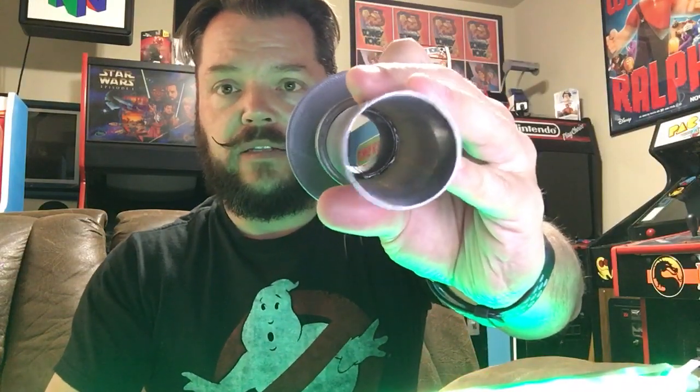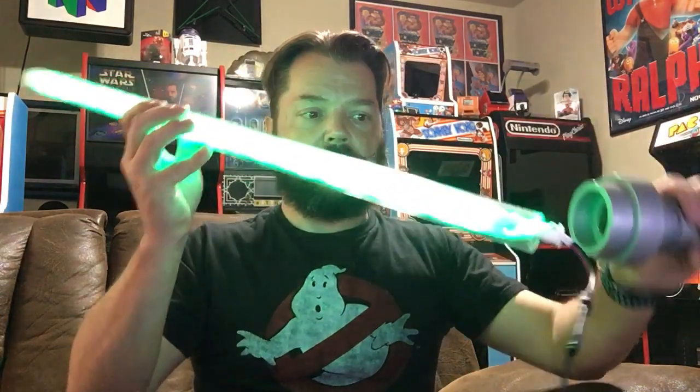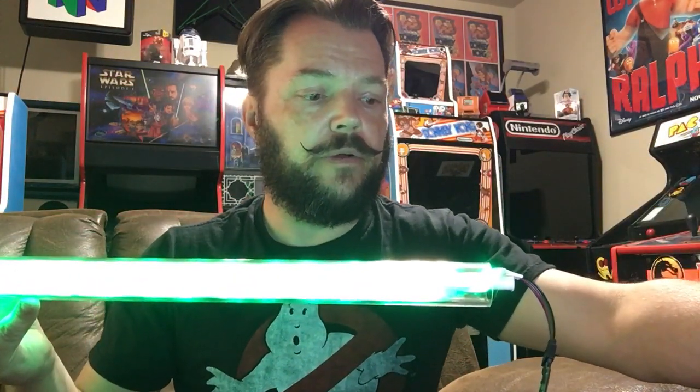I did scale it — it doesn't fit on the one-and-a-half-inch plumbing pipe directly; I think I had to scale it to 0.78 or something to fit, but play around with it and make one yourself. You can make it with or without the blade. I think he has a model where you don't even have to use metal tubing. I just used the real thin-wall metal tubing so I could fit the electronics guts inside. I had to 3D print a sleeve that makes up the difference between the ID of the tube and the OD of the poly tube so it's a nice snug fit. Anyway, I wanted to share that with you — I'm going to put the rest together, and if I'm wearing the same clothes in the next video it's because I went ahead and did it tonight. Thanks for joining me and I'll see you next time.